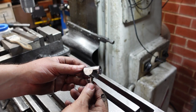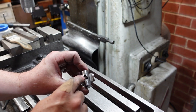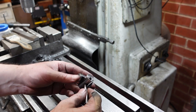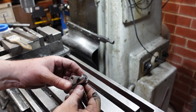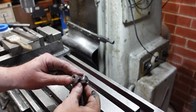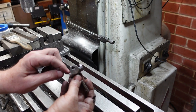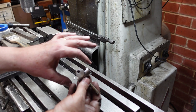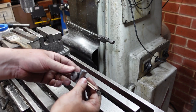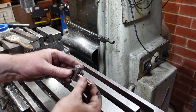This is what my two pieces look like on a tap once they're all drilled and tapped. The top piece locates on the square for the tap drive and the bottom piece locates on the round shank. Because these holes are perpendicular to the flat surfaces and the flat surfaces are in contact, you've basically defined an axis perpendicular to this plane. What I need to do now is make up a holder with two cross-drilled holes which are square to that axis — and then the axis of that holder will be the axis of the tap.